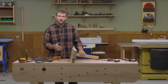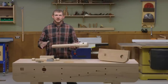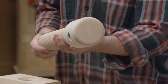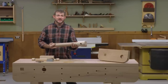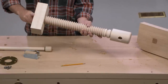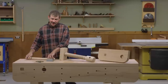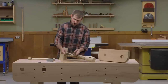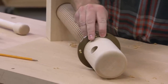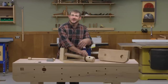All we have to do now is drive a wedge, then work on the hardware to get it mounted. For this bench, we opted to use a purchased wood screw kit. The wood screw is traditional but pretty hard to make, so the CNC-cut kit in hard maple is beautiful and silky smooth. We have the wooden screw, a hard maple nut that fits on the end of the screw and sits behind the apron, a handle, and a bronze garter. The bronze garter fits around the hub on the wood screw and attaches to the front of the vise, tying everything together — as you loosen the screw it pulls the jaw out; as you tighten it, it pushes it in.